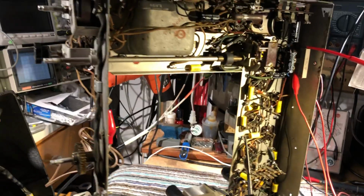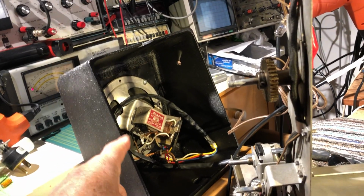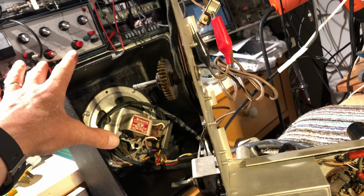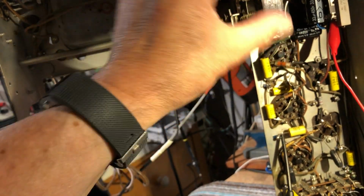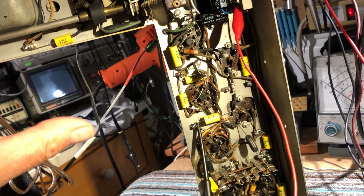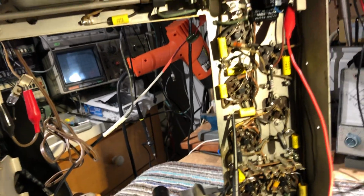And it's just going to be tested on its own with the speaker. It's not the original speaker, but it's a field coil speaker. But the field coil impedance is quite high. I think the resistance there is something like 1750 ohms. Needs about 800 ohms. So what somebody previously had done had put a whole string of resistors in here of the incorrect value to make that 800 ohms. I put a single 1500 ohm resistor in here, 10 watt, which with the voice coil plus this makes about 800 ohms total. So that should give the right voltages in the circuit.